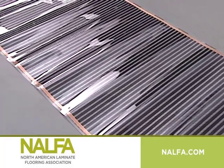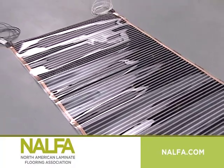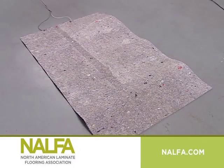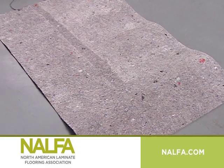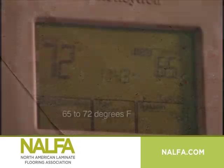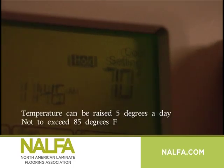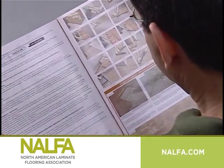Most laminate flooring can be used in combination with many types of in-floor heating. The heating system can be cast in a concrete floor, in a thin layer of filler on a concrete subfloor, installed under a wood subfloor, or installed on the surface as matting. The heating system must be in operation for at least two weeks prior to installation. It may be turned off or set to a suitable installation temperature of 65 to 72 degrees Fahrenheit. After installation, the temperature may be increased slowly at approximately 5 degrees per day and should not exceed 85 degrees Fahrenheit.